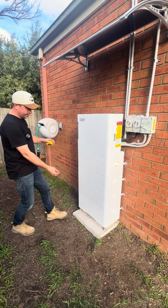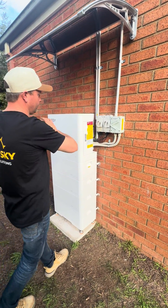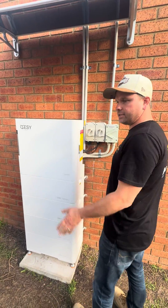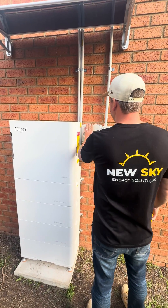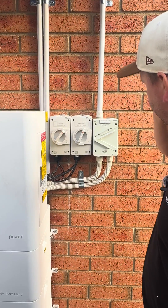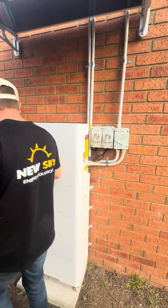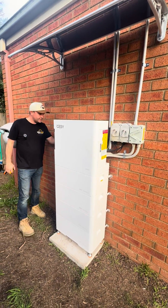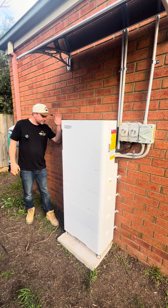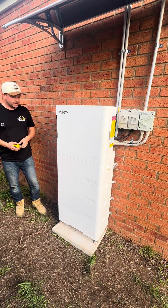The batteries and the inverter have no physical cabling on the outside. There is cabling for the solar, and when that gets connected it doesn't have built-in DC isolators, so we've had to install our own here. It does have backup capability, so we've got two supplies — the grid and the backup. This will back up to 26.9 amps and it is IP66 rated, including all the batteries.